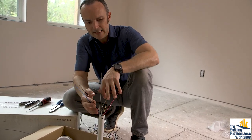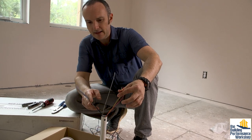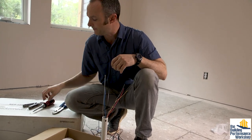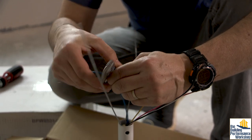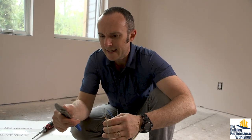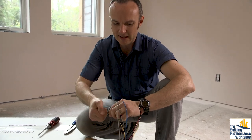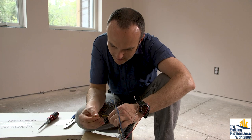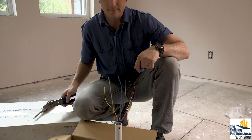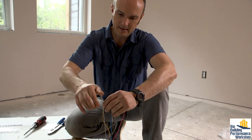When you get the fan out, you'll see what all these wires are for — they power different things inside the fan. These are for the fan itself, and these are for the light, which we don't have on this one. For those who don't know, these are called wire strippers — a multi-tool for electricians. The tool has instructions on it telling you what size hole to use for which gauge wire. This is 22-gauge wire here, and this is a slightly thicker gauge, which means a smaller number. Once exposed, I twist them to make sure they're ready to be attached.